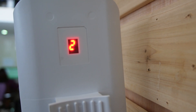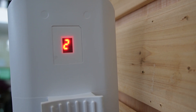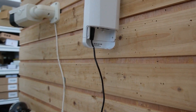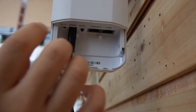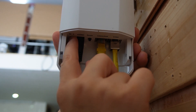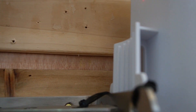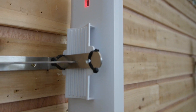Now we can see the channel is number 2, and I'm going to press the button. So it's on channel number 3 now. Doing the same thing on the other wireless bridge — it is already powered up. I'm going to plug in two ethernet cables since we are connecting two IP cameras. On this side, make sure you put it to S mode, and again I'm going to press the reset button to change the channel to number 3. So now they're matched with each other.